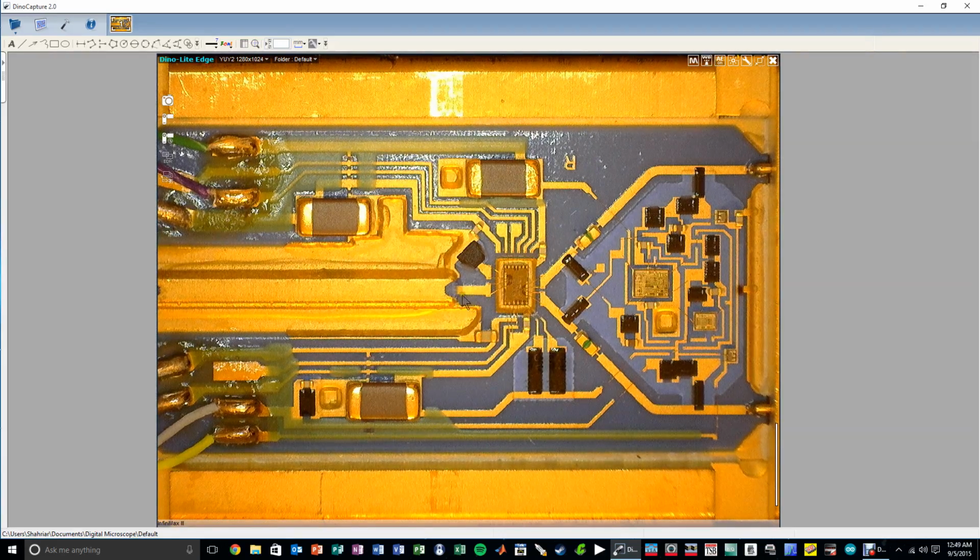Pretty cool to see here that you can see the blue material is filling inside the tube here, and everything also is pretty straightforward. All the biasing of the indium phosphide chip clearly comes from here. Everything is wire bonded, double wire bonded on the 25 GHz inputs and outputs, as to be expected on something for this frequency range. Then we have the input to the probe up here, positive and negative down here, and you can see that they both come in through microstrip transmission lines, and look, they seem to be AC coupled first before they go to the input of the indium phosphide chip.